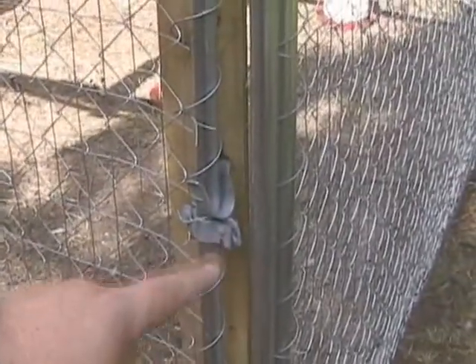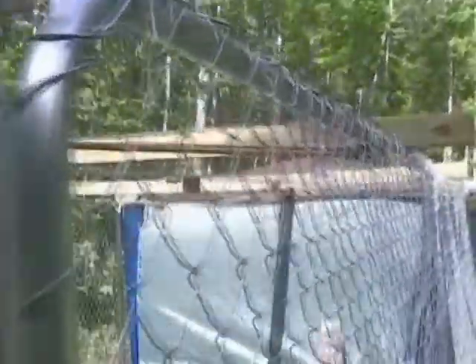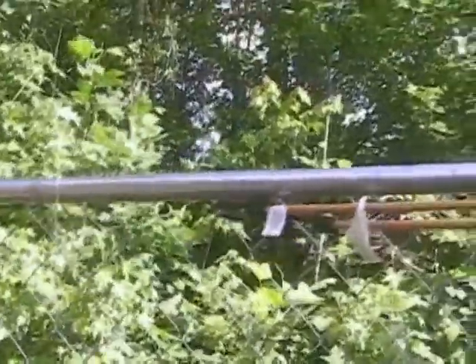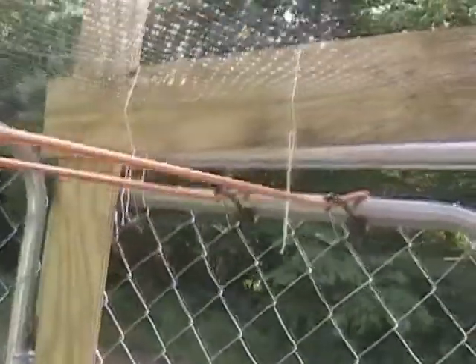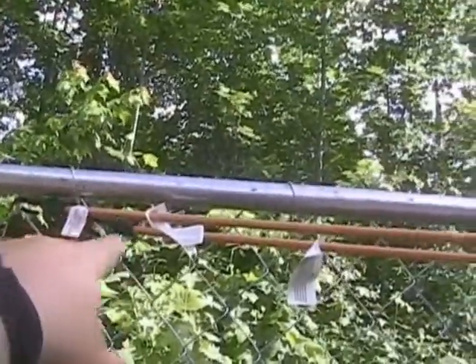The other deterrent is sound. If you have small people helping you on your farm like we have here, they're prone to leave gates open. But if you'll notice here, this gate takes human strength to open and it auto closes. What I've done is use two bungee cords. The only reason I use two is so that if one fails or pops off, it's a double safety. Interlock it behind the chains where it locks onto the gate and the same way you interlock them on your fence.